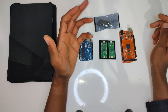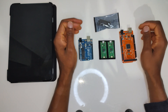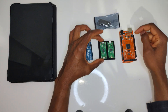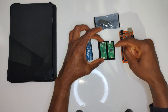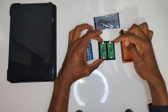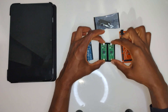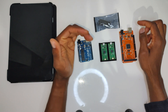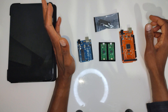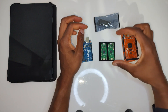For IoT, all you need to do is trigger some activity that sends you a notification. Because the Pico W has Wi-Fi built in, you could, for example, attach a motion sensor to it. It has a built-in LED, you can attach a speaker or buzzer, so when it detects motion at a time when there should be none, the LED comes on, the speaker makes noise, and the device sends you an email or notification to an app of your choice — all because of the built-in Wi-Fi. This makes it a great option instead of the traditional Raspberry Pi, which is very hard to come by right now due to chip shortages.